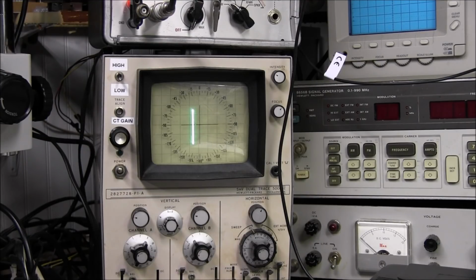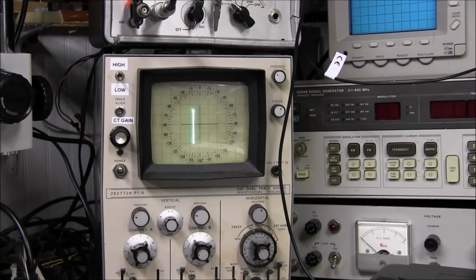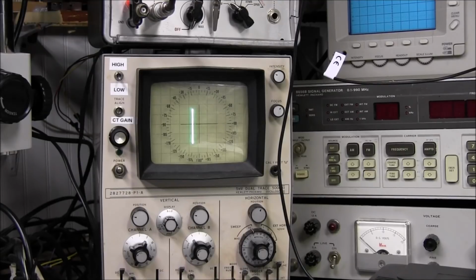And it could be, you know, it was just the way when it was made, something didn't go right, they didn't check it, and it shows up as a short. This way on the curve tracer, you can be sure if the component is fake or if it's something actually wrong with it. So no, I'm gonna say that is not a fake capacitor. That is actually a bad capacitor from the supplier.